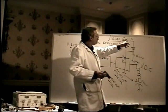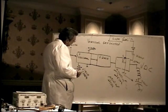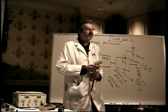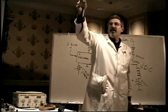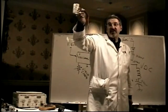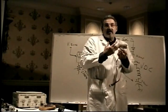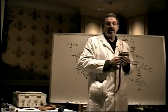Okay. You should always have 1.2 ohm 2 watt resistors. They're real common failures. That's one other thing I wanted to mention. Very important. If you read Vertically Challenged in last month's Slot Tech magazine, when the remote adjustments board is not plugged in properly, you also lose vertical deflection. If it's not plugged in at all, typically in most monitors, you don't have any vertical deflection, because if there is a vertical hold pot, it's on this board, and then the oscillator doesn't work because the vertical hold pot's not hooked up. Okay?